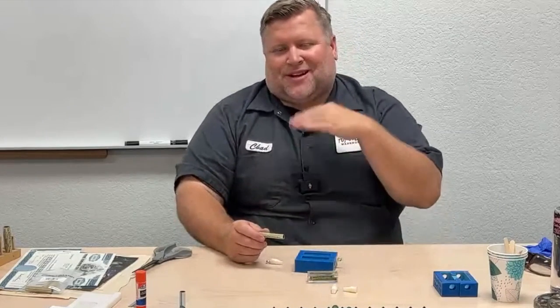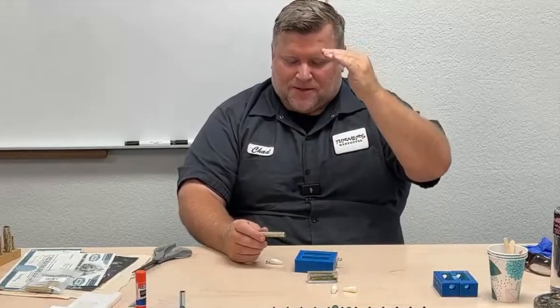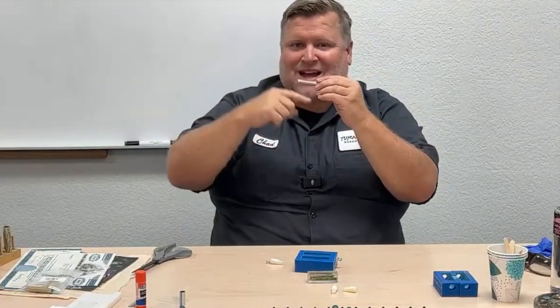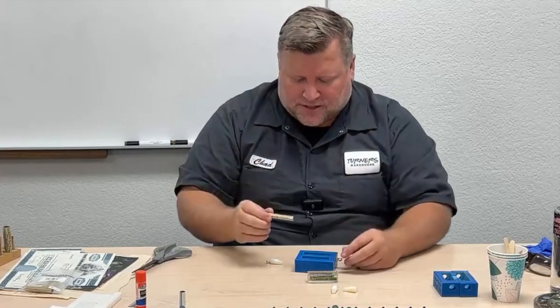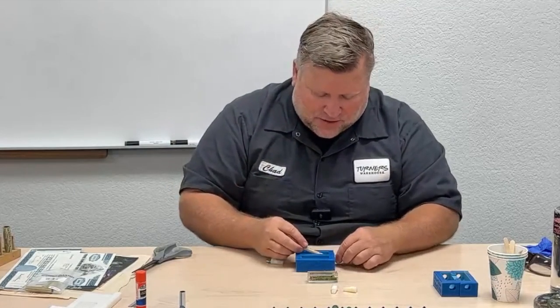And that way, if there is an air bubble trapped on the seam, it has the most chance to leave from the top. If you have the seam on the bottom and there's an air bubble trapped, chances are it's not going to get around that tube. Even with pressure, it might sit there and cling. So I would put the seam on top in your cast.